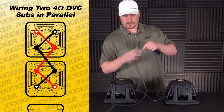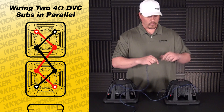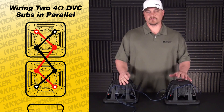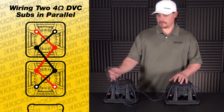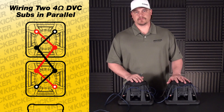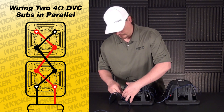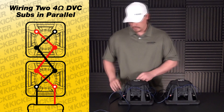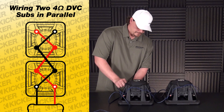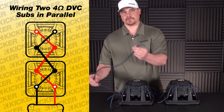The signal runs out to the amplifier. Once you get a lot of wiring into the terminal, squeezing another piece in gets a little hard, so what you can do is jump over and pick any woofer you want as your last sub in the setup. Basically go to your red with white dot as your positive, and then come over to your black with white dot as your negative — and that will be your lead-out to your amplifier.